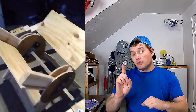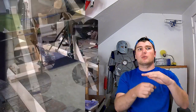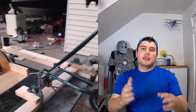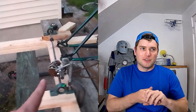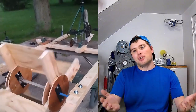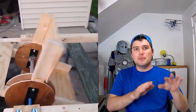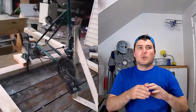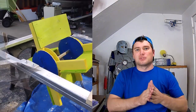The reason I'm bolting everything is: number one, we can take it off later if we need to, and number two, by bolting it you drill a hole first and use compression force to hold the paddle wheel mounting bearings, as opposed to torsion force from screwing into wood which could break it. At this point we started building the bicycle part. Unfortunately we were running so fast on time that I didn't film all of it. We got the paddle wheel mounted and I quickly welded together a bicycle frame — we only had half a bicycle frame and couldn't find a whole one in time. This is the day before the race, and we haven't even got the jack shaft on yet to transfer power from the bicycle to the paddle wheel.